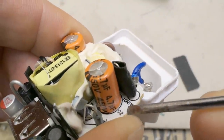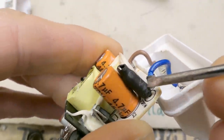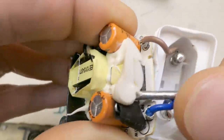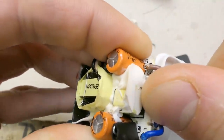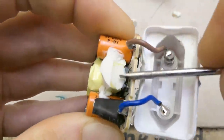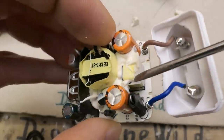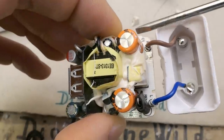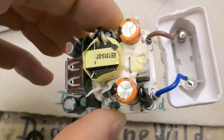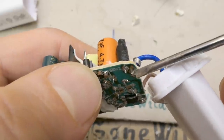It seems to be much more properly built. There is a fusible resistor — 10 ohms, one watt — in heat shrink for more safety. And there is an interference inductor; the cheap ones have no interference filter, but this one does. The mains basically goes through this fusible resistor into the bridge rectifier, then into one of the capacitors, through the interference inductor, and then to the other capacitor on the primary side. So it actually has two primary smoothing electrolytic capacitors, not just one. And those wires have crimped terminals — they are not just soldered in directly, for more strength.